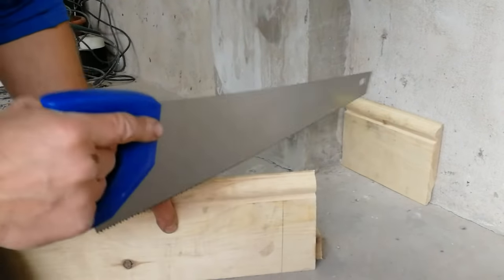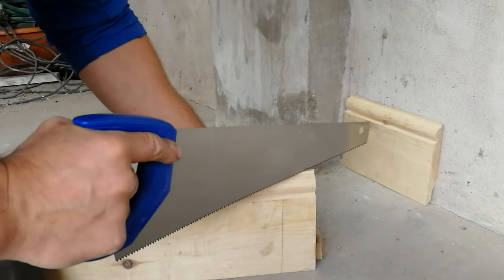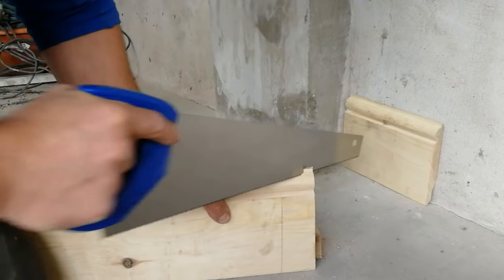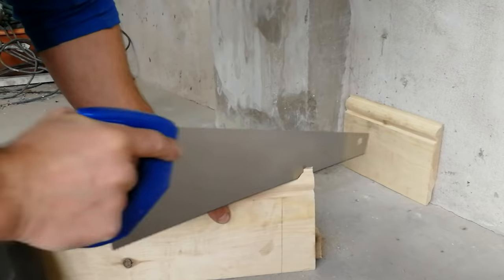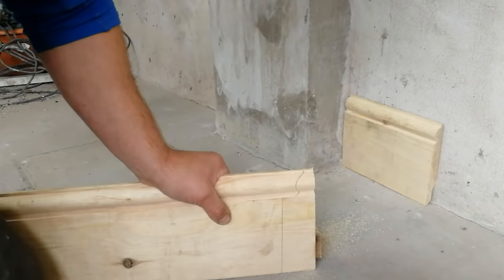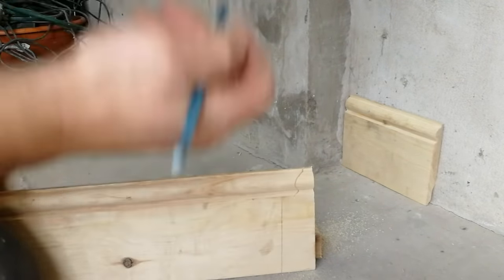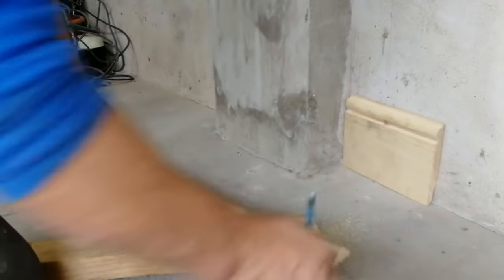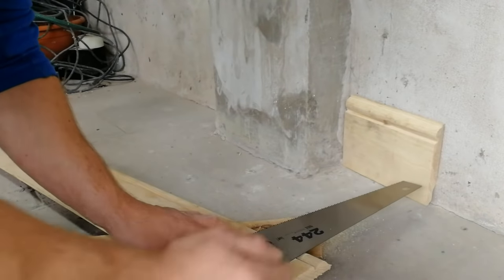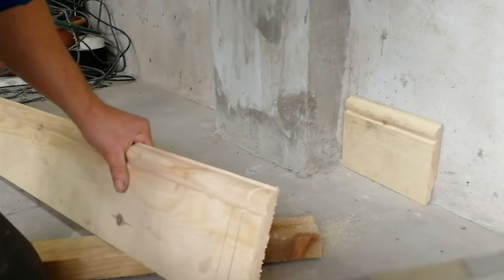You should be able to see that. So I'm going to cut the 45, kind of close in on the edge somewhere — even on that pencil line, that's another one. So I'm going to cut down 45 with nice short steps. No need to do long strokes, just nice and short. So as you can see, I've cut at 45 degrees down to this mark there. I'm going to hit the pencil and put a pencil mark down there, using the saw as a square. These saws have got a knife in them, so they're not too bad.